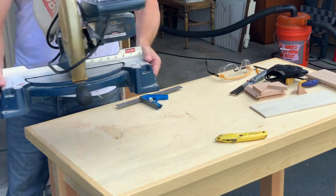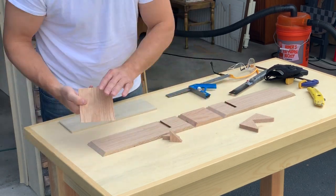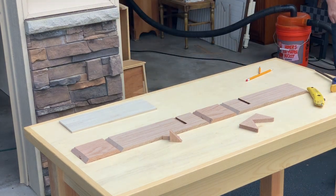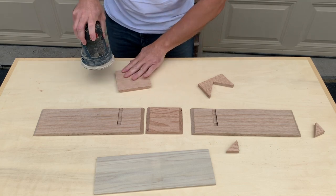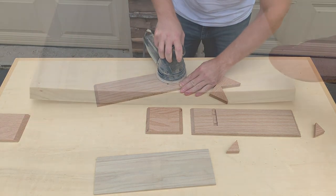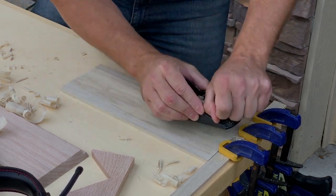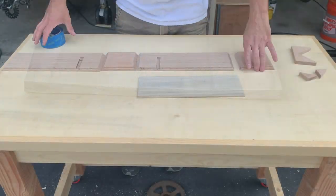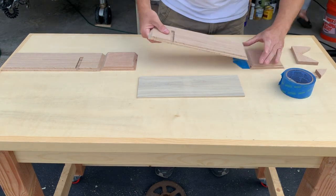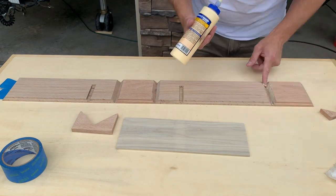After finishing up at the miter station, I went over to the assembly table and laid the box pieces out for sanding. Then I sanded everything to 220 grit. While sanding, I noticed the poplar bottom had some cupping to it, so I brought it over to the jointer to flatten out the side that would face in the box. My jointer is kinda lazy, so I ended up having to go with a good enough approach. With everything sanded up, I went back to the assembly table to prep for glue up. I opted for the painter's tape clamping method, so I got all the corners aligned and taped up. Then I started gluing it all together, including the neck support and the bottom.